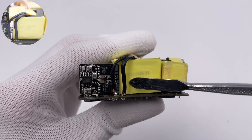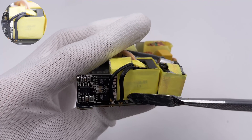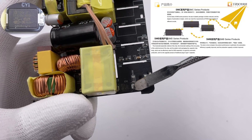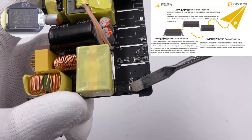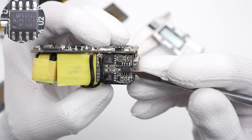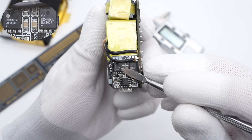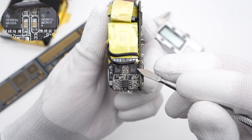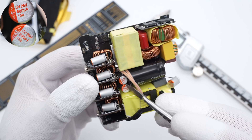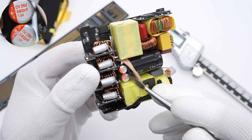The LLC transformer is tightly wound with tape. The low-voltage side is connected to the synchronous rectification PCB through two black wires. The white optocoupler is used for output voltage feedback. The SMD white capacitor is from TRX. The LLC synchronous rectifier controller is from MPS and integrates two controllers used for synchronous rectification of two secondary coils respectively. The two synchronous rectifiers are from Hantec, DFN 5×6 package, 65V, 3.8mΩ. Two solid capacitors connected in parallel are also from CHN CAP, 25V, 680μF.